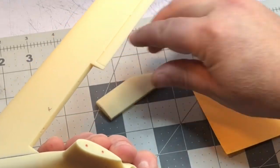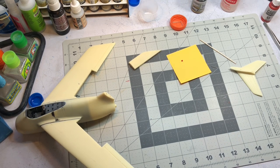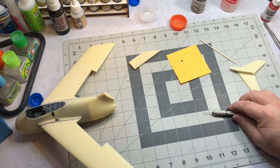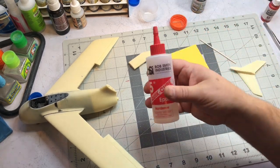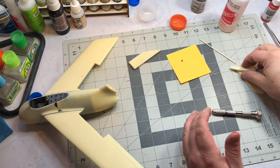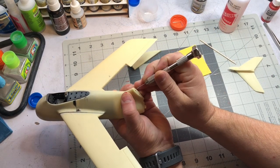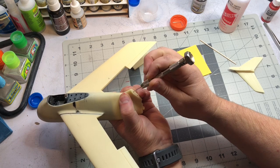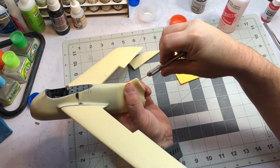In order to make up for minor errors, you can drill them just slightly larger than the diameter of your pin. That way you can move it around and adjust it if needed. Once I drill the holes I'm going to glue with five-minute epoxy, which will fill in any wobble or blank spaces from the pin being slightly smaller than the hole.